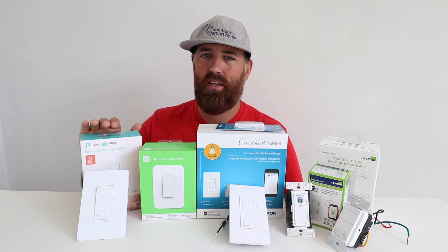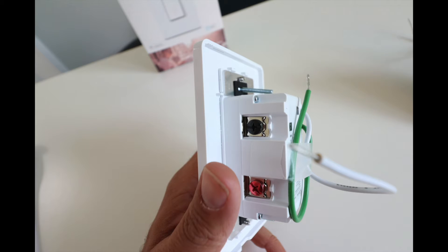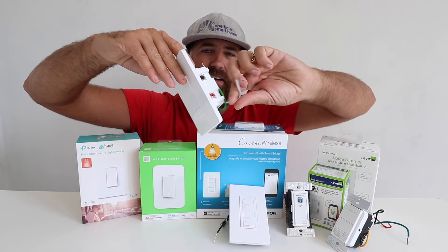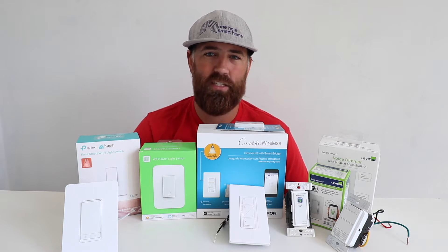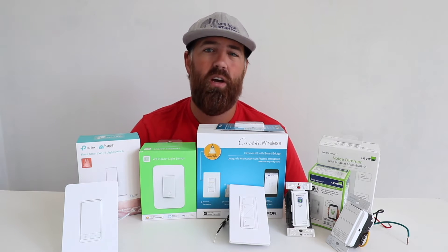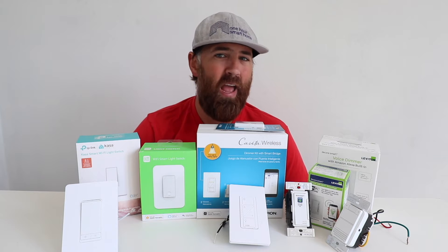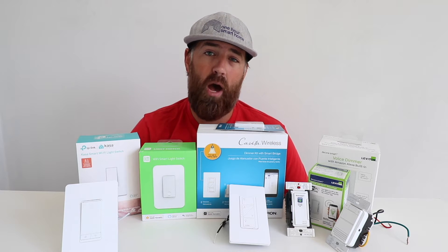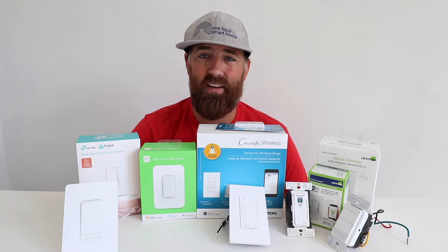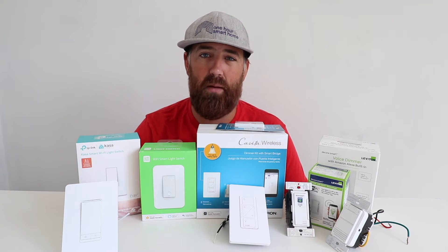The only disadvantage of the TP-Link light switches is that they don't have three-way dimmer functionality and they do require a neutral wire. You can see here on the back of this TP-Link light switch that neutral wire is required for installation. In most homes built after 1980 you're going to have a neutral wire in the switch box, but not every home will. If I had to estimate, probably 90 percent of homes built after 1980 do have a neutral wire, so if you have a newer home you're probably good. We're going to include a link below on how to identify if you have a neutral wire — that's the number one thing you should do before you buy any of these.